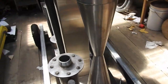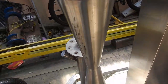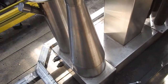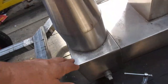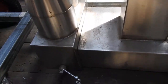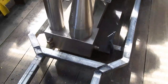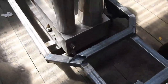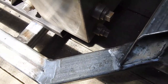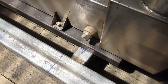There's an interesting arrangement here where you've got the cyclone sort of device that we're so familiar with, and it's connected with an inverted one. I don't know whether that inverted one performs a function, but it appears to dump its load into this box, which doesn't appear to be gas-wise connected to the other one. It has a drain port, so presumably I'll be extracting condensate from there. There are two more drain ports down here - the bottom one is obviously a drain port, the top one might be a vacuum test port.